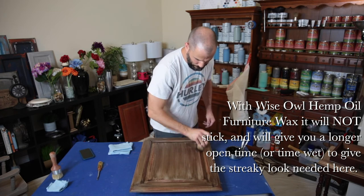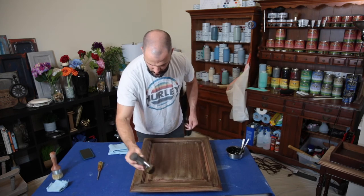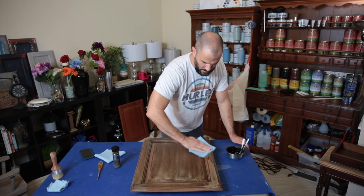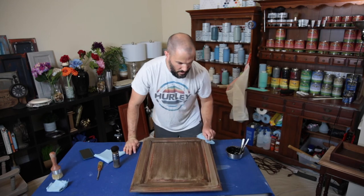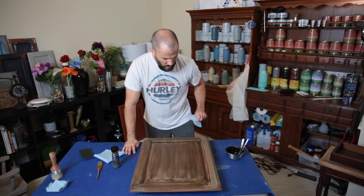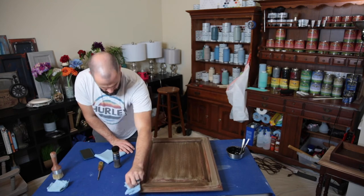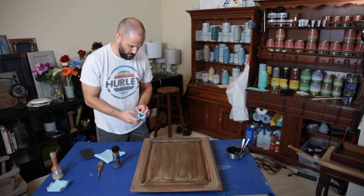And I'm not gonna lie, this is tricky, because you have to just trust the wax to do its job, pulling it back and forth. But the more friction you get to it, the quicker it's gonna dry. So you'll feel the friction of it. Okay, then get your rag, and you're gonna pull in the same direction as the grain that we have created. And it's gonna get all over your rag, because there's a lot. And this is where something I don't normally do, I'm gonna go back and forth with it to really rub the dark wax in, one, into all the lines that we've already created, and two, to really give it that pronounced brown look throughout. See, it's starting to build up, so if you folded it like you should, you just find another side that doesn't have a ton on it.